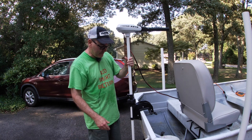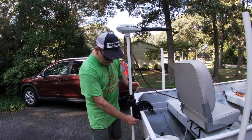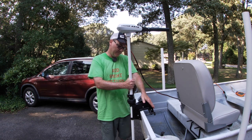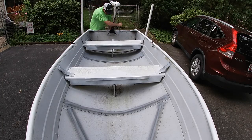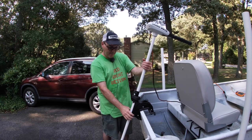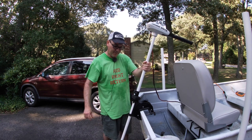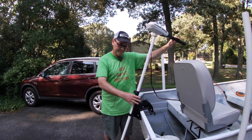The basic functionality is that just like any other typical outboard, you have two clamps that hold it onto your transom. There's a pin which allows you to adjust the angle for how it sits on the back of the boat — there's the first position and one other position. There's also a lever to tilt the motor to different angles depending on your needs, and to bring it all the way up for transport. A nut here tightens or loosens the rotation so that as you're trolling it doesn't swing around too easily — you can adjust this tightness to whatever you want.